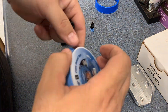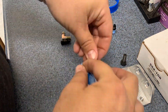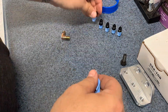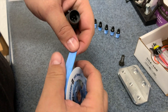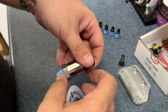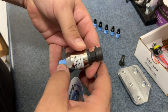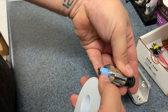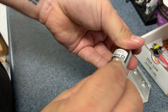You can see here the method I used to apply the tape. The tape should be on the threads only, not in any orifice of the fitting, and it should be wrapped in this direction so the tape doesn't come off during assembly.